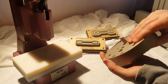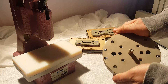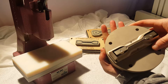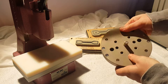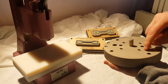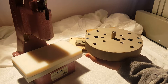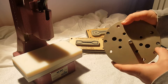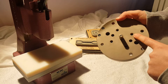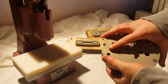This spring mechanism is removable. If you need to sharpen these dies, they can be sharpened by really anyone. These can also be loaded onto any sort of press. Right now I have the pin in here — you can unscrew this pin, which will leave you a flat back so you can flatly load that into a press. Or if you have any different type of fixturing that you need, there are four inset M8 screws, so you can attach any sort of fixturing that you need.